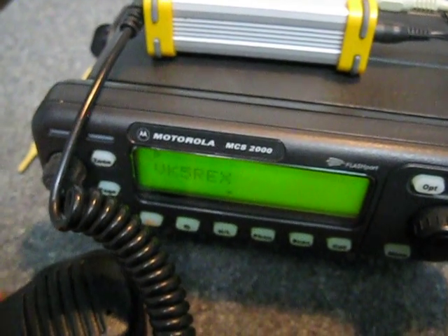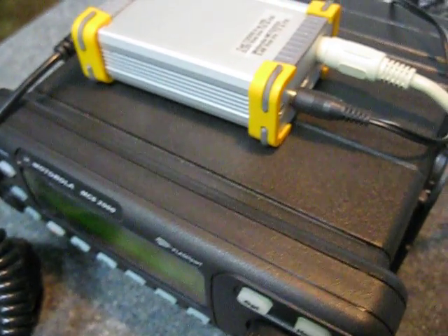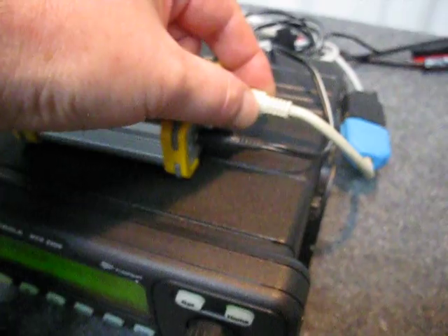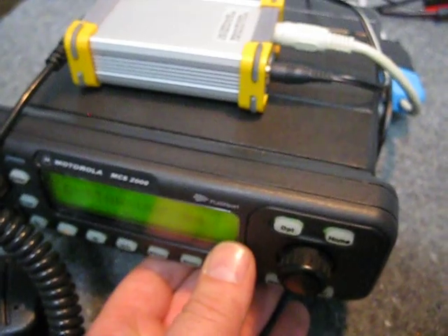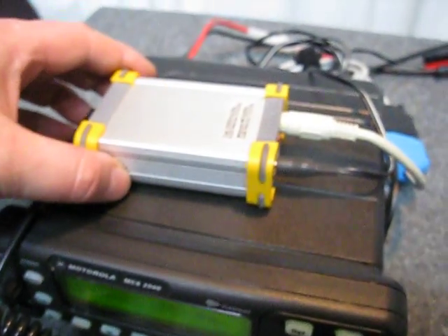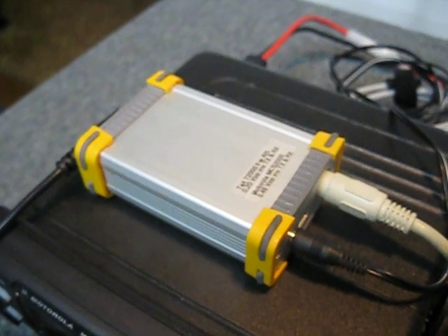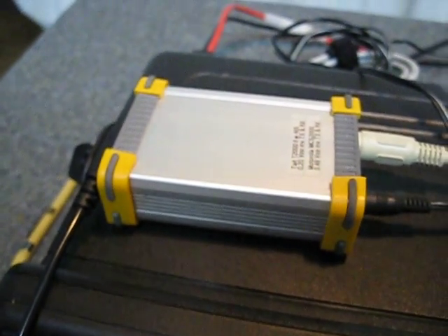OK, there you go — that is a Motorola D-Star radio. In effect, it could be any brand of radio, as long as it's got the 6-pin mini-DIN socket for an amateur radio rig and can go into 9600 baud mode. Or indeed with a commercial radio like the Motorola, or any other radio that has a discriminator out and flat audio in to the modulator, you can turn virtually any radio into a D-Star radio with this board. Unfortunately this version of the board is no longer available — the team in Germany are working on the Version 2 board, which has the AMBE vocoder chip on board as well. Looking forward to seeing how that turns out. This is Michael VK5ZEA — thank you for watching, seventy-threes for now, and we'll talk to you again soon.